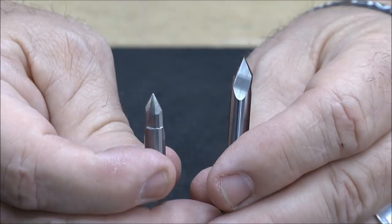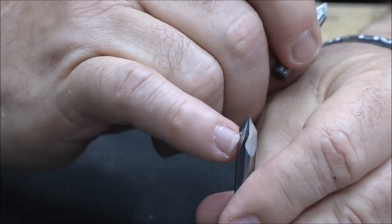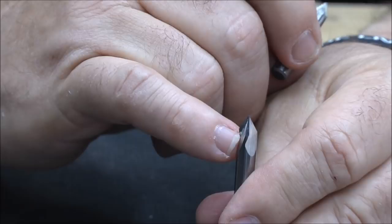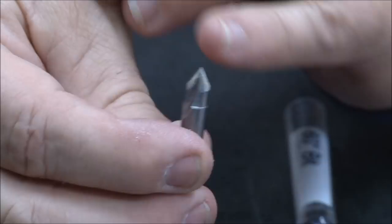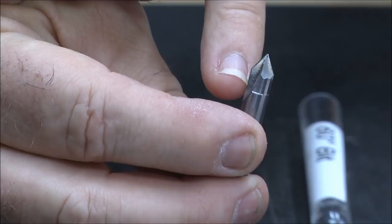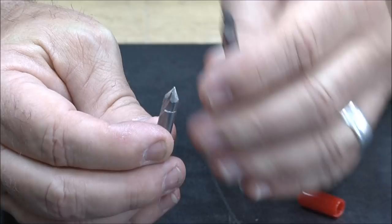What I really like about the Amana 60 is its design. With the Whiteside 60, if you go too deep the bit would start burning because there's really no cutting flute beyond a certain point. But with the Amana, you can cut much deeper — clear down to the shoulder — and you're still using flute, much like the 90-degree bit. That's something you just can't do with the Whiteside 60, so in my opinion it's again a superior bit.